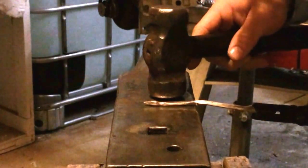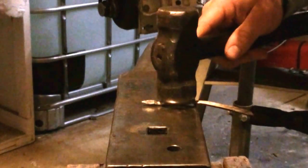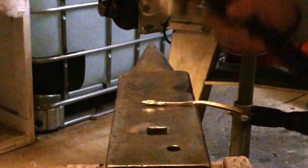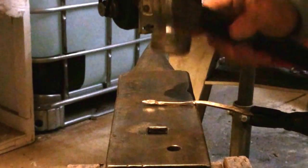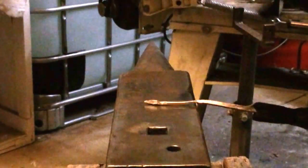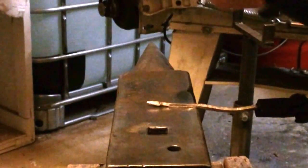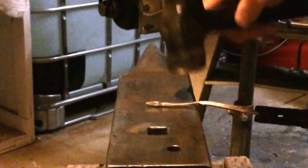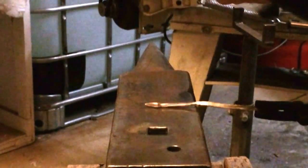When you tap the anvil, it brings the hammer back up for you a little bit. If I were to strike the work and then decide I didn't know where I was going next, I'd have to stop the hammer — it takes a little effort to stop it from going down and a little more effort to start it up again. So: strike, strike, I'm unsure — tap — there's my spot. I keep my rhythm and lift my hammer again.